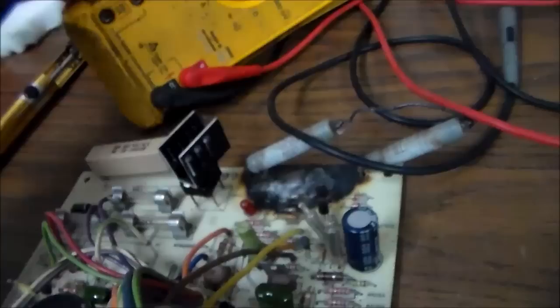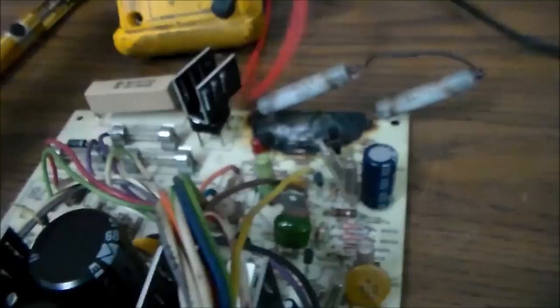Let's see. And I'm going to tell you the kicker here in a minute. By the way, we're going to fix this, so don't get discouraged, but it's just amazing what you run into sometimes. If I can get my multimeter out. Let's see if that's a 1.5 ohm resistor, if I can do it with one hand, with all of the scarring on it.